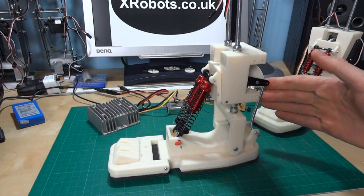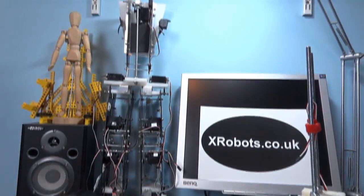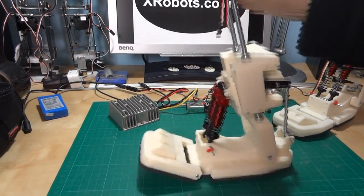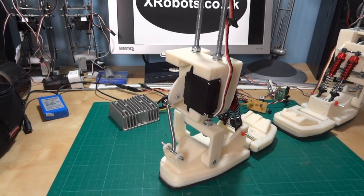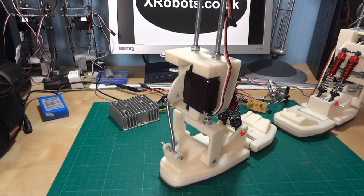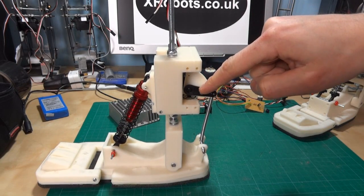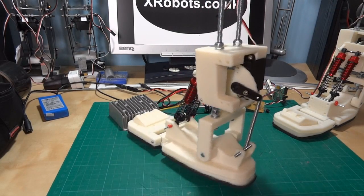The intention is that I've not got any fixed or rigid rods attached to the servo to any piece of this. I've got Android 11 just over here which I've now stripped some pieces off, but I managed to break the servos in that — I managed to strip the gears by dropping it on its feet. Whereas with this version I can do what I like and it never back drives the servo. The servos I'm using in this version are much stronger; they've got metal gears. In Android 11 I used some servos I got off eBay from China which were around £2.30 each. These ones are £15 each and they're capable of 15kg of torque at one centimetre radius from the rotation point — the stall torque is basically lifting a weight of 15kg, which is quite a lot. The others are about 3kg. But I still want to be really careful, which is why I've built the leg this way so no matter how much you smash it into the ground you can't break the servo. Well, that's the theory anyway.